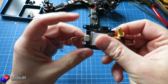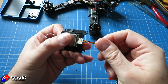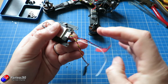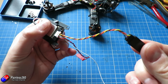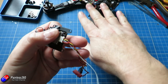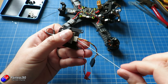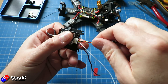How do we wire this in electrically? There are four connections. By default it has the wire that goes to your camera, the power supply for itself, and the wire for smart audio. We are only going to need the video cable out of the three-wire camera connection because we don't want the video transmitter to power the camera — the camera is already powered by the flight controller. So I'll use the red and black power wire along with the white smart audio wire, and then the yellow video wire from the camera connection.